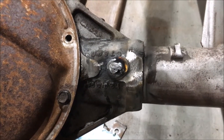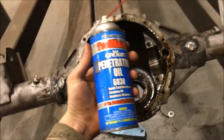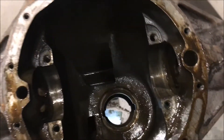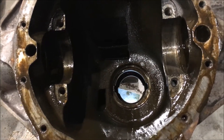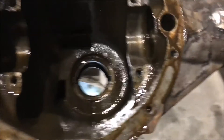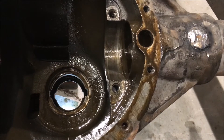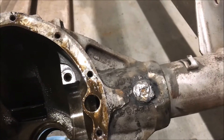The plug welds are re-welded. For my test, I took some penetrating oil and sprayed it into that gap on both sides. I'm going to let it sit overnight and I'll know in the morning if it's leaking. The front side is easy to test; for the backside I can flip it the other way and do the same thing.